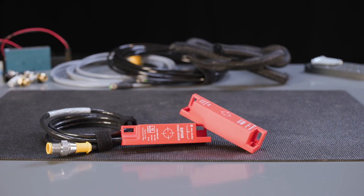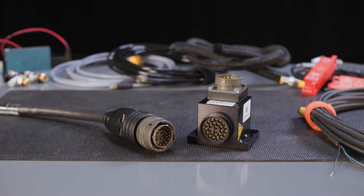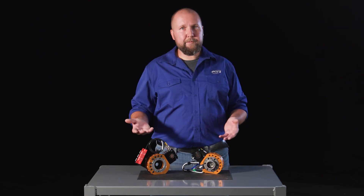You also need tube fittings, safety logic, sensors or switches associated with safety, and management of the tool changer's lock and unlock sensor wires, and an additional module for IO and/or tool ID.